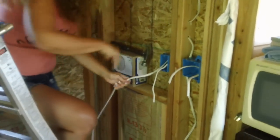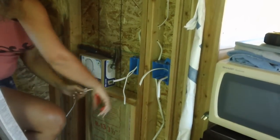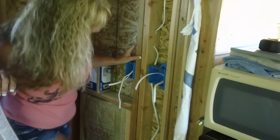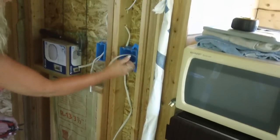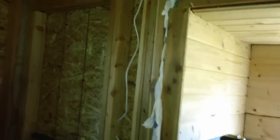And I need to cut that off. Yeah, you can cut that off. So the switch then comes down to the outlet here, which gives me power up. And I've got my outlet which comes up here to get power from this box. And then this outlet is what's actually coming all the way over from — the home run — it goes all the way back over, up through everything, and back down into the breaker panel.